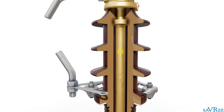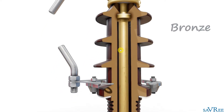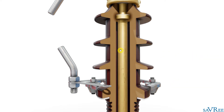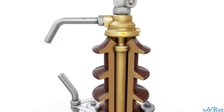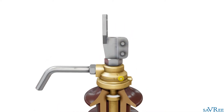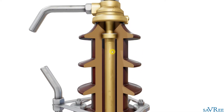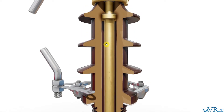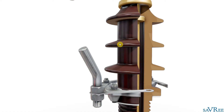The center conductor is usually manufactured from bronze, aluminum, or copper. Remember that bronze itself is a copper-based alloy, which gives it its copper color. Whatever material is chosen, it's going to be a very good conductor of electricity, because this conductor is going to be live — it may be at 3,000, 6,000, or 11,000 volts, depending upon the electrical system served.